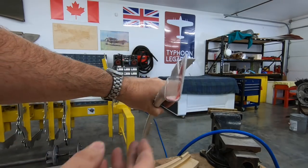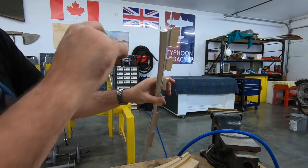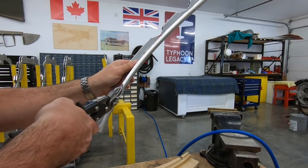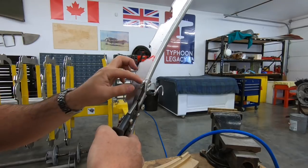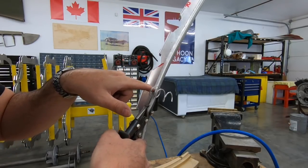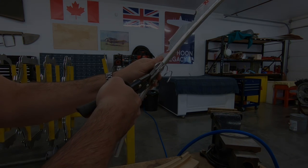If the aircraft nose is that way, this is how it would sit — you can see the profile. The outer flange on the skin has a varying angle around it; this one's 90 degrees. We've got to trim this and true it still though. One thing to note: never cut to the end of the shear. If you snip off the end you'll get a crack coming off the end of the shears and into your material, and it's always going to go into where you don't want it to be — you'll scrap the part just like that.